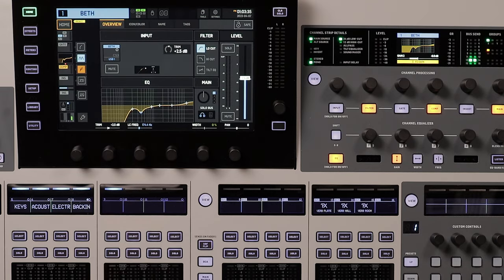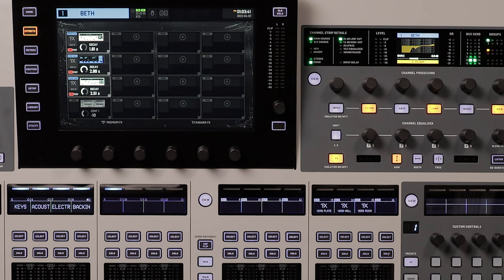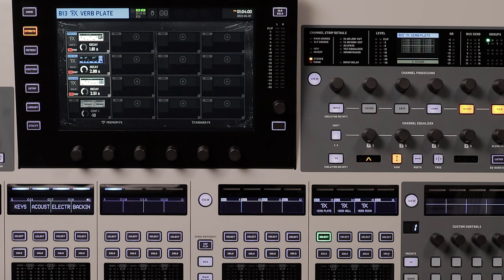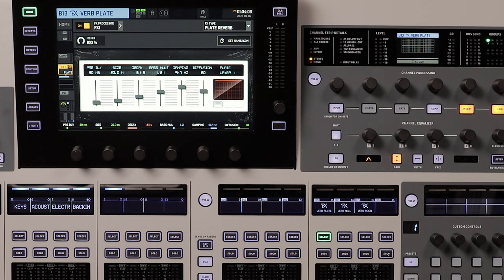Setting gain, EQ, compression, and gating is just quick and easy on the Wing's touchscreen. And then it came time to set up reverb. I went to the effects screen and expected something similar to the X32, but it wasn't. On the X32, this is where you'd program all of your effects settings and which channel or bus is going to use that effect. But on the Wing, this is simply an overview of the effects that you have loaded into your mixer. All the settings can only be accessed on the channel or bus you have that specific effect loaded into. For example, I loaded a plate reverb for the insert of bus 13, and that's where I can adjust all the settings for that reverb. Once it's loaded in, you'll see it listed on the effects screen, and tapping the effect takes you right to that channel or bus. So the effects screen is basically a shortcut — really easy, as long as you're not expecting it to be like the X32.